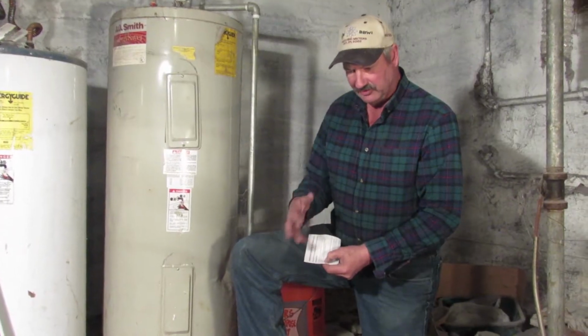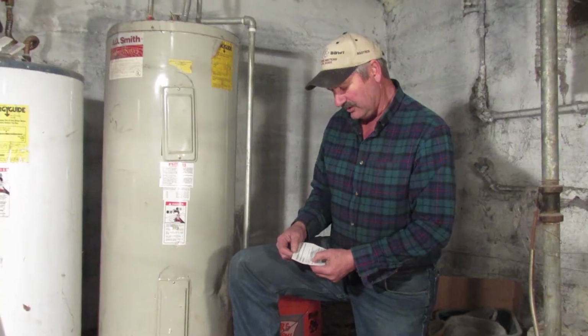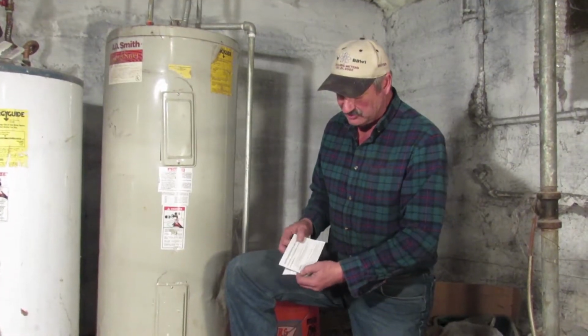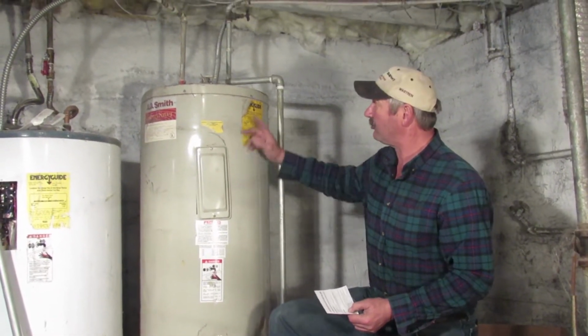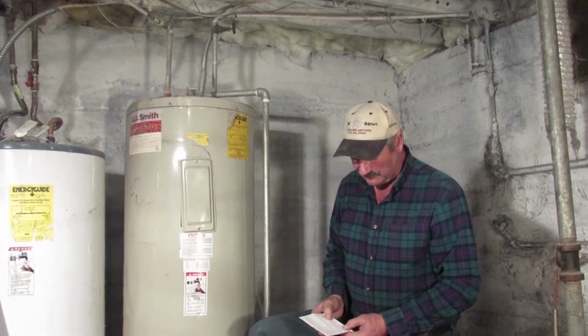We've got a regular drill as well as a cordless one. And then never unscrew any drain valve or the tool or any plumbing fixture while it is under pressure, and that's kind of obvious. Then there's some notes and precautions, and the first one's on venting, and this is just stuff you need to know before you start. Whenever you're draining your tank or filling your tank, you need to vent it by opening up a nearby hot water faucet or the pressure relief valve to let air come in or out of your tank. Otherwise the water can't come in or out.